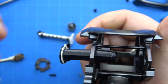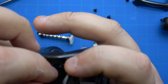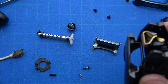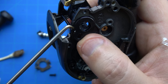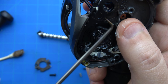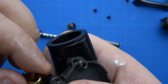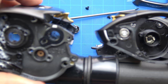Now we're going to start putting it back together. This reel has a very specific way in which it needs to go back together. We're going to start off with the worm gear shroud and the t-wing. Don't forget to put the t-wing back in. Make sure that the little white piece of plastic is oriented properly. Look how they're aligned in order to tell that they're functioning properly.